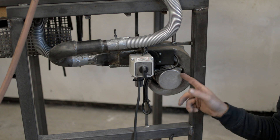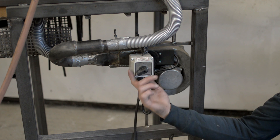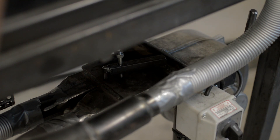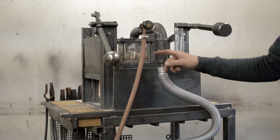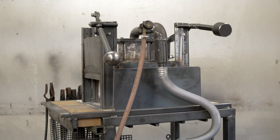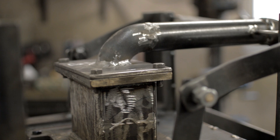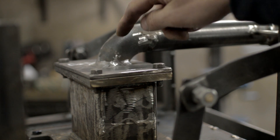Here on the side is a blower that regulates the amount of air going to the burner. The air goes up and mixes with the gas, which is regulated with a needle valve, and then the air and the fuel meet at the top of the burner.